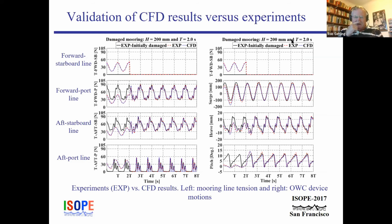My experience in offshore structures more generally indicates that you have about 8 mooring lines used for a structure, as against the 4 that you have done for this exercise. If you had more mooring lines, that gives you less effect coming onto the floating platform when one fails. So did you consider other mooring arrangements, such as having 8 mooring lines rather than just 4?